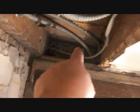So there's a new cable. I ran a 14 gauge wire with 3 conductors, 14-3. It comes up to here, and here's my next box. So Romex from below comes up. So you have one circuit from the 14-3, you have 2 hots. The red hot goes, this is the cable or the load side that goes up the wall to an outlet in my bedroom above this door, and then the line continues up into the crawl space over and powers my light upstairs, the ceiling light.